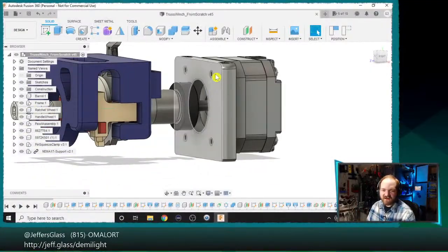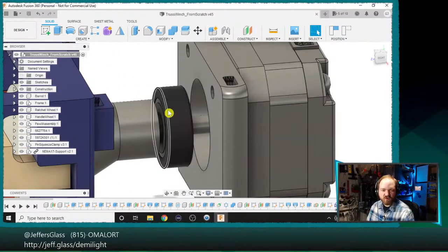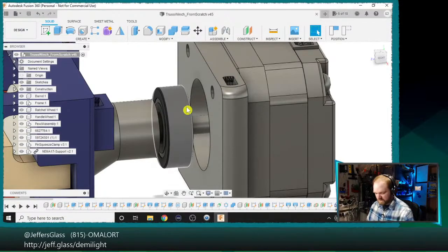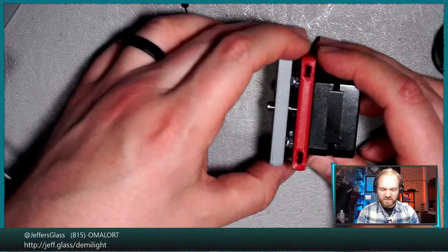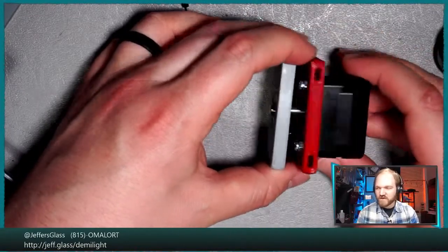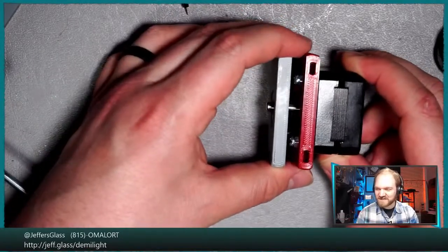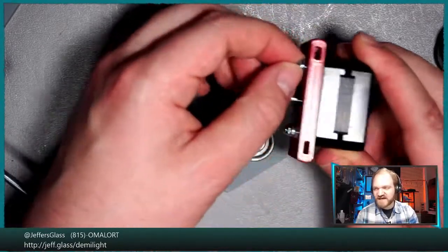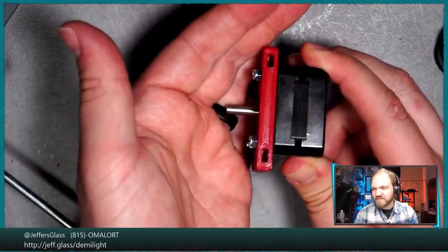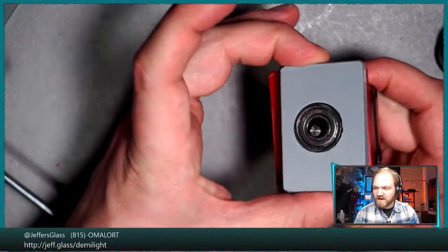So right in front of that mounting plate, there will be another very similar mounting plate that's going to hold a bearing here. So that is one of something like this. That bearing is going to be right here. In fact, I'm not 100% sure with the hardware that I have holding this NEMA 17 stepper motor on if I have enough clearance to actually put this bearing mount here, so that might be a problem. I'm sure we can figure out a way to slim this down. You can see I had to put a jam nut in there because my M3 screws were just a little bit too long. But I might be able to pull some hardware to slim those down. So we'll put a bearing block in there.